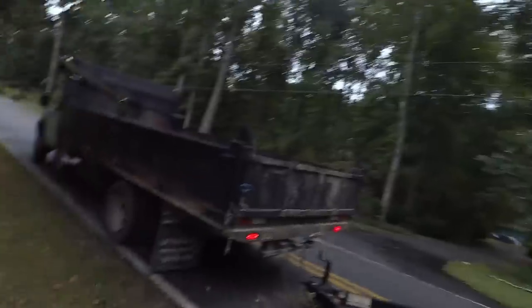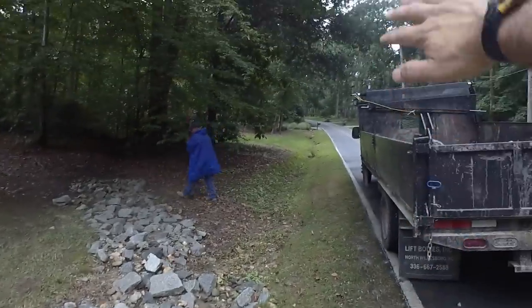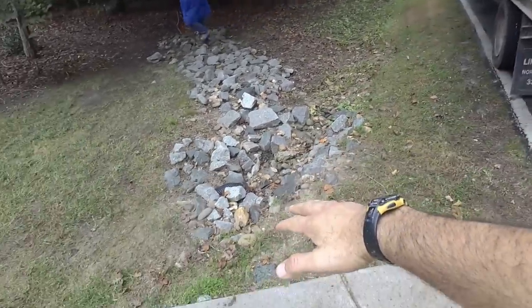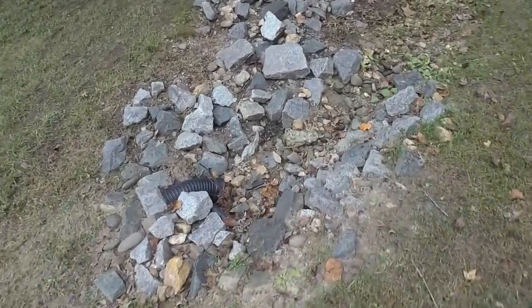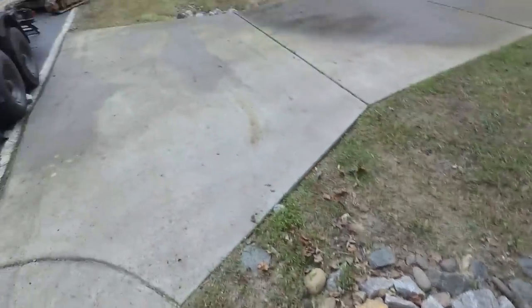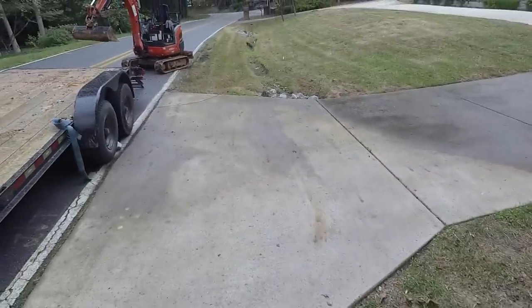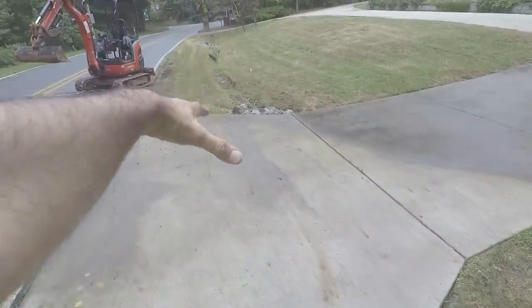This is Sean. We're on a job today in Greensboro and we've got a drainage ditch across here. What's happening is the water is coming way down this hill, hitting here, the pipe's all clogged up. The culvert's too small and the concrete people who poured this second apron here just kind of threw a small pipe in here, and what it does is it just completely overflows and then it's digging all that out and running that away.